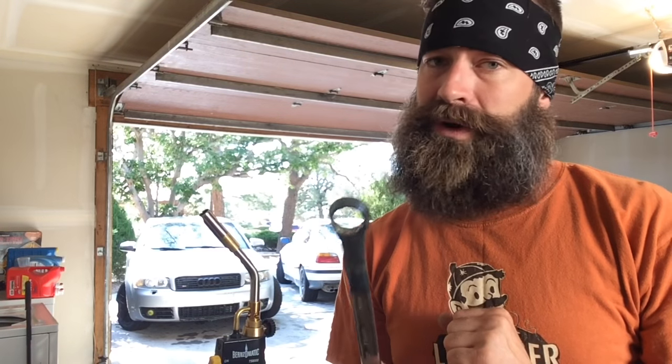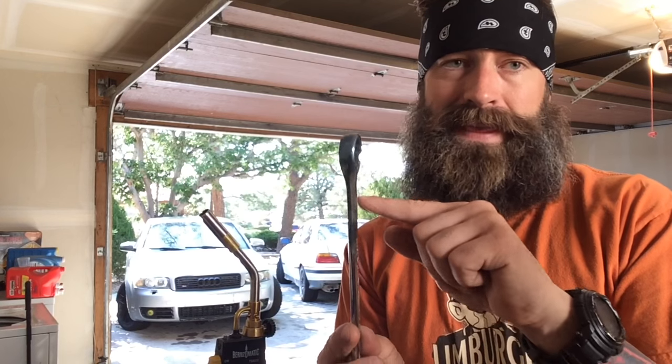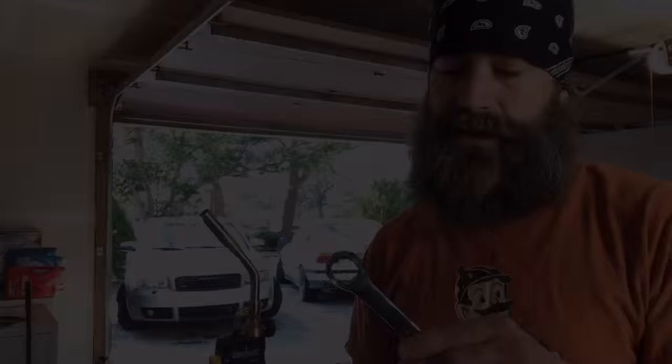I'm going to be using the angle grinder, but I was thinking about this build, and if you didn't have an angle grinder or a belt sander or any other kind of power tools, you would be able to accomplish this still, because all it's going to take is heating it to bend it a little bit. You could cut it off with a hacksaw, and then if you want to spend the time doing it, you could take just a regular rasp to get the edge on there, and then a rat tail file. You could absolutely do this build with nothing but hand tools.